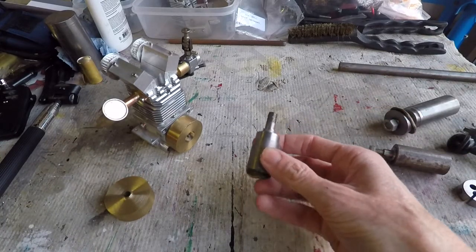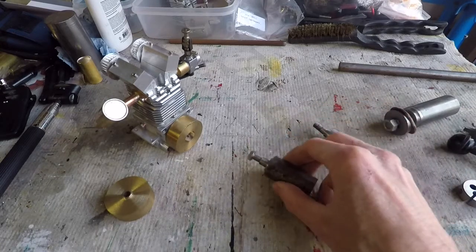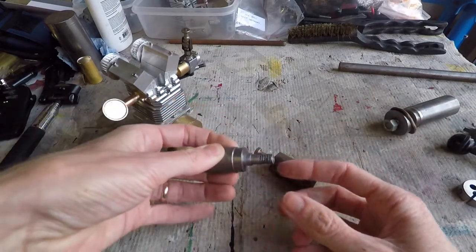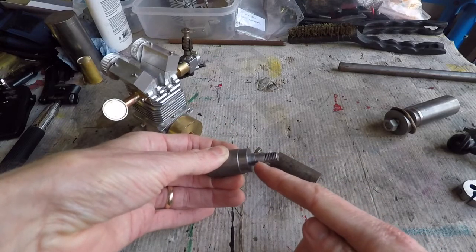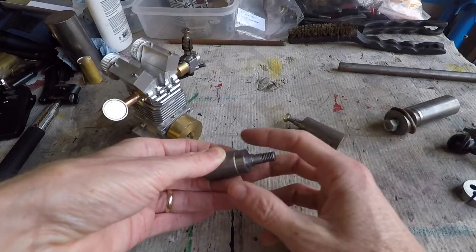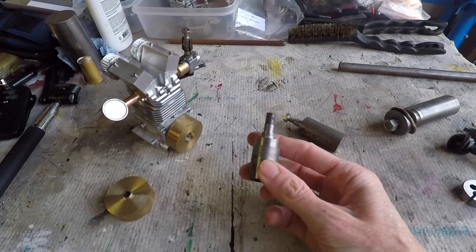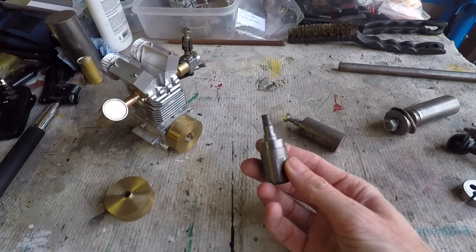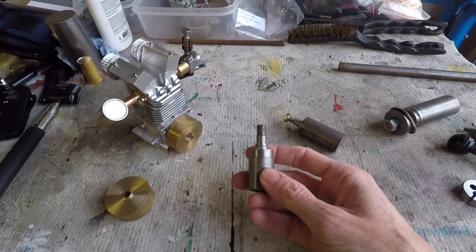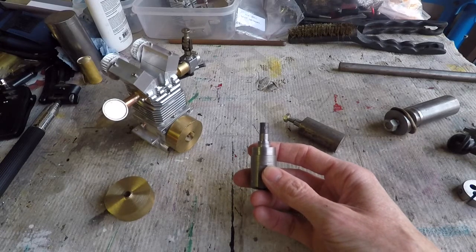This is a common machining trick. Here's one that I made earlier. Basically what it is is a piece of stock that's held in the chuck, and then you machine a section on the end and put a thread on that which holds your part. The trouble is that once you've removed one of these from the chuck you've lost the concentricity, so basically it's scrap. So you need to make a new one pretty much every time, unless you're prepared to clock it straight using a four-jaw chuck and a dial test indicator.